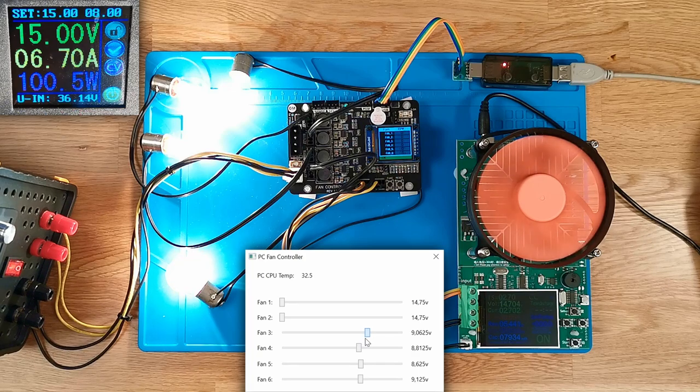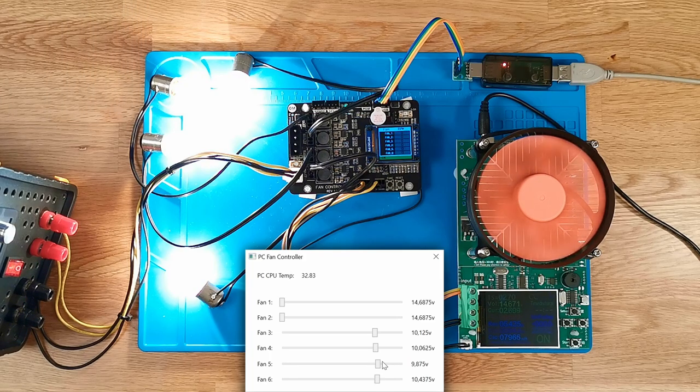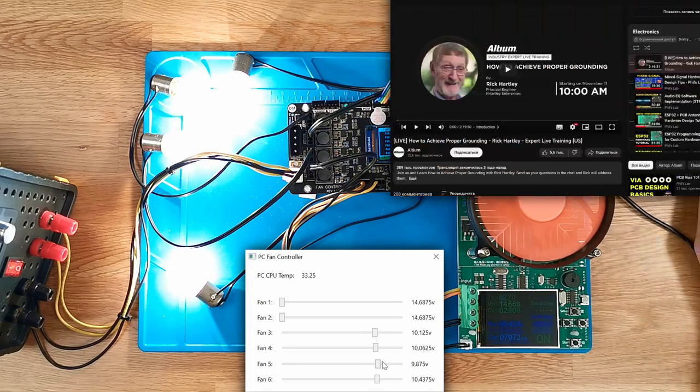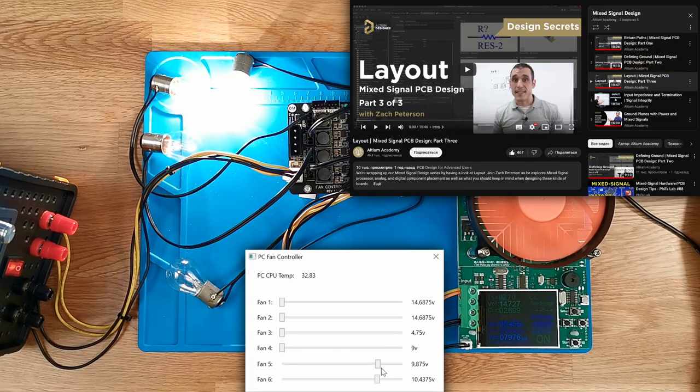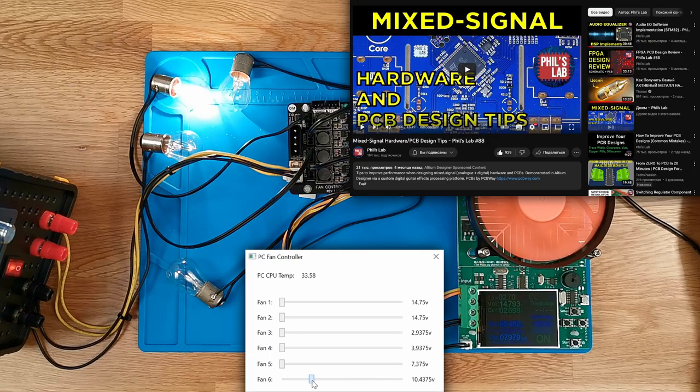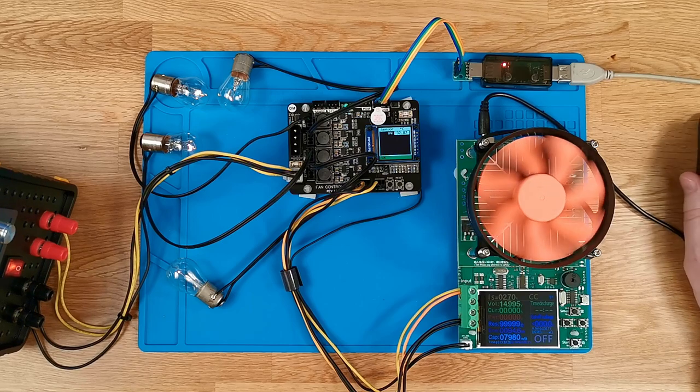100W consumption confirmed. Since we need to account for losses on wires and DC-DC converters, let's add another roughly 10W. The PSU under load kicked its fan to maximum. Great — shame I don't have a thermal camera. Now we can confidently say that a single shared ground works fine, provided components are placed sensibly and additional ground layers are used where needed. I studied many materials on this — lectures and articles — and the consensus is: if you can avoid splitting the ground, it's better not to split it. I also think this device would work fine even without internal ground layers for ordinary fans not consuming 15W or more.